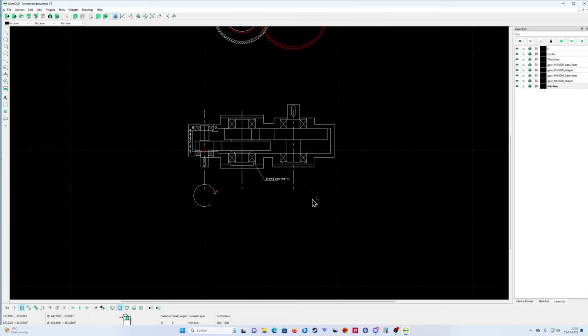And then normally you have a drawing like this, and sometimes to make it more clear, you can also make a front view of the complete gearbox. Normally you do that when there are pipes outside and things like that. Then you also put a top view or side view that's important for the pipes or attachments on the gearbox.